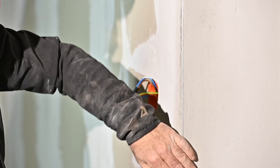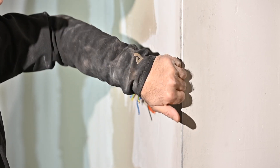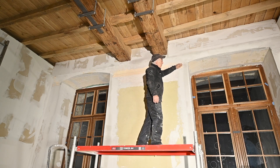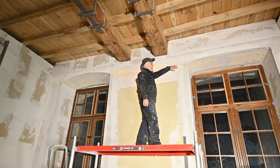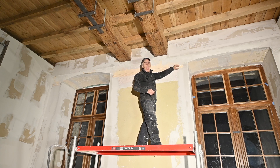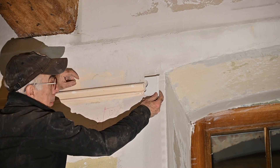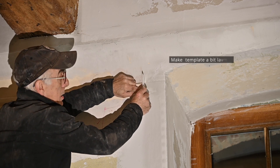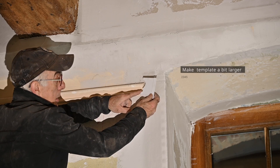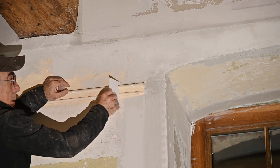This is how it looks when done with sanding — a very sharp, clean, and strong corner. One other problem I had was that a molding was missing on the other side, so I had to create a new one. The way to do that is by making a template: put it along the existing molding, use a pencil to mark it, then cut it out with scissors. I used a piece of hard plastic. Then you can recreate that molding very simply.